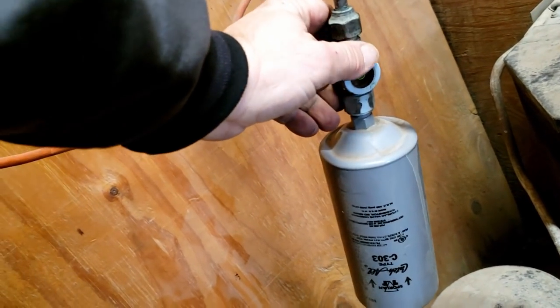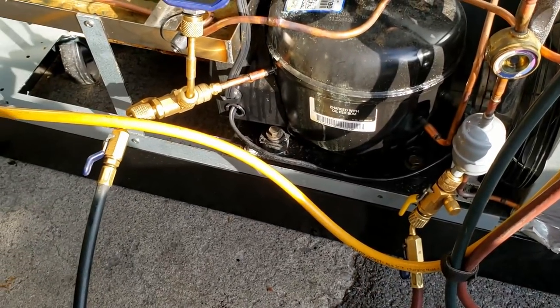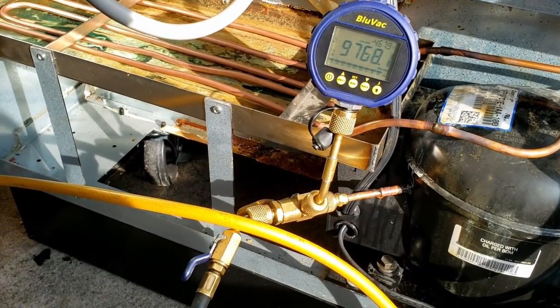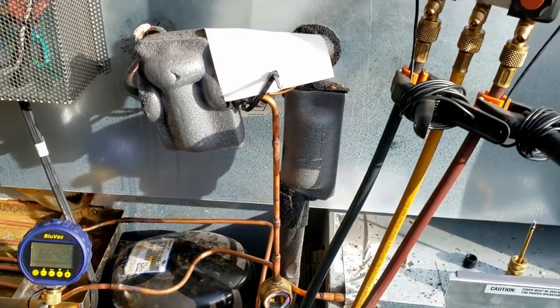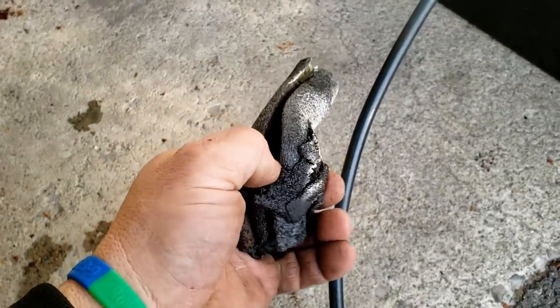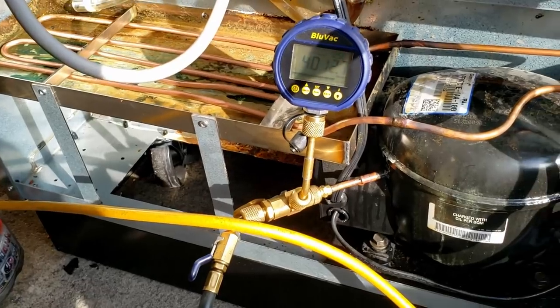I took a check and it's still nice and solid and holding temp, so doing good in here. Needed some electrical — we've got that here. For experimental purposes I went ahead and yanked the valve cores, just seeing how fast this thing pulls down. It's been forever since I used the regular hoses, seeing what it's doing. Doesn't seem to be doing too horribly bad. This thing only holds 13 to 14 ounces. I've got to finish getting some of this put back together. I'll let this pull a vacuum while we're waiting, and we'll get some of these other things tied in.